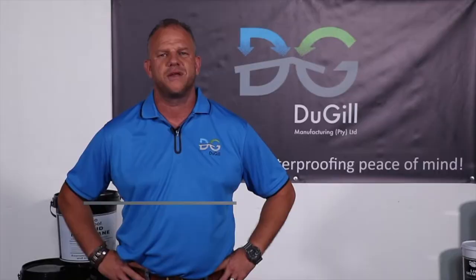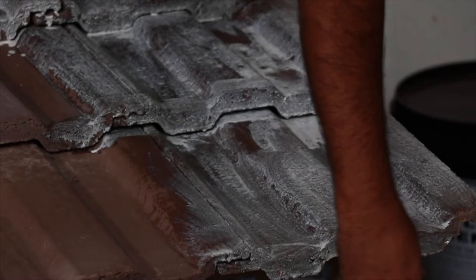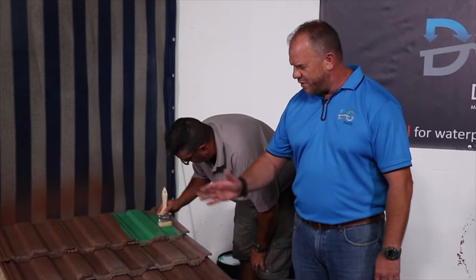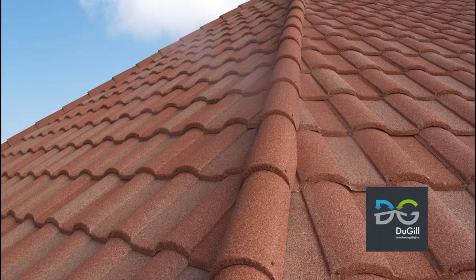I'm going to explain to you how to seal and waterproof a tile roof with our product. It doesn't matter what tile roof it is, always make sure it's clean — you can just clean it with normal water. Make sure all dust and flaking paint is removed. After the roof is clean you will apply our Fuse product. The Fuse product sucks into the tile and seals it, which helps when you apply the EcoCoat on top so you won't use as much of the expensive product. A good indication that it's dry is when there are no more white little spots and the roof is quite shiny. You can apply it by brush, roller or spray machine. Stick with the grain of the tiles. Also make sure all chipped and broken tiles are replaced before you apply the EcoCoat on top of your roof.